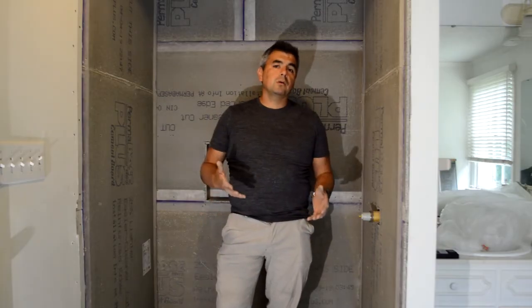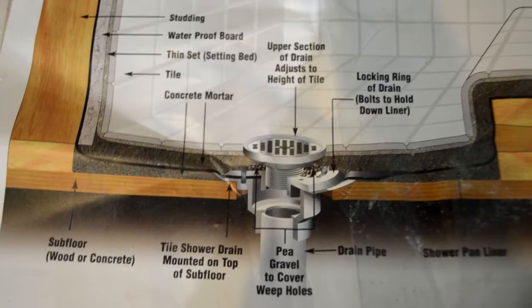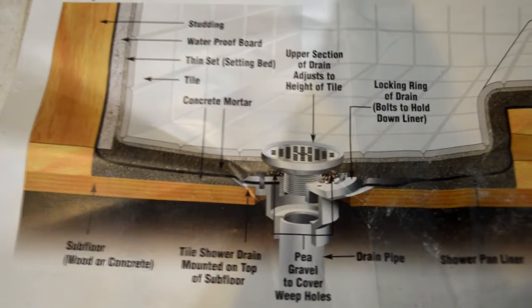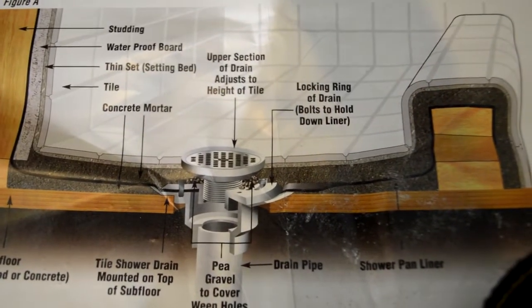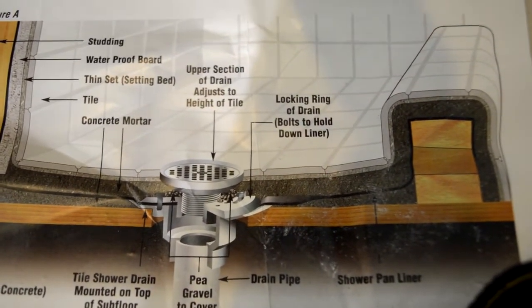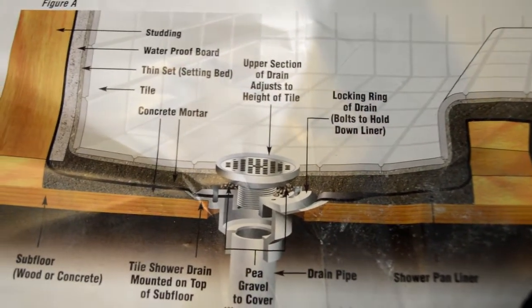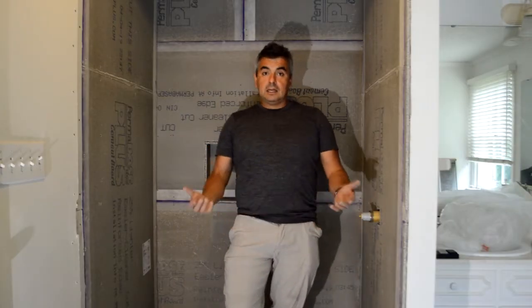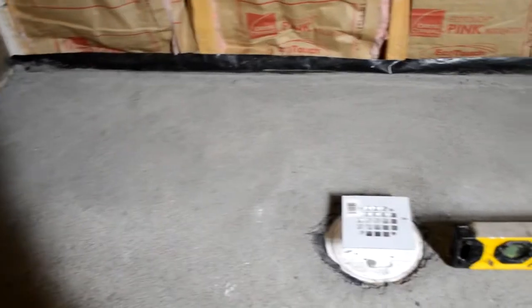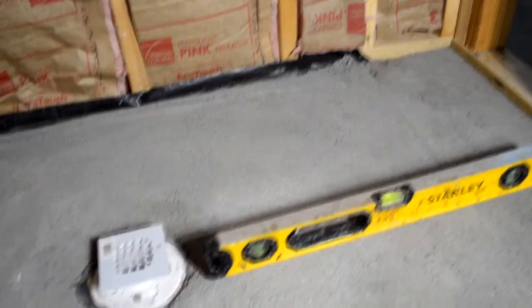But now they say, well, we don't want you to open the plug when you're testing the shower pan and have water staying in little corners and things like that. We want to make sure that all the water goes inside the pan before you put the last layer of concrete, right? That's the bed of concrete. And that is achieved by using something called a pre-sloping, right? Pre-sloping is the way you do a little pre-inclination toward the drain over the wooden surface.